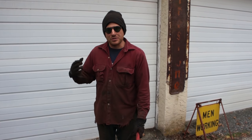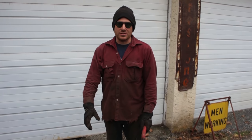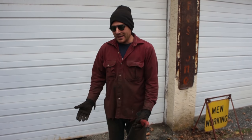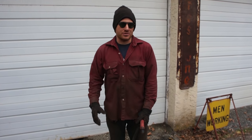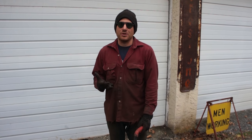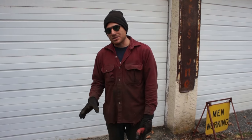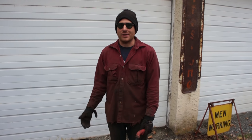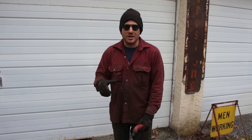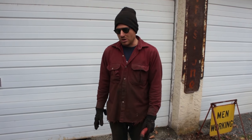One thing to mention when you're using a plasma cutter, the air pressure is what actually forces the molten metal or slag out of the way, and you need that air pressure to punch through. So you do need a decent compressor to keep up with it. Traditionally, Eastwood VersaCuts, I think they say to max it out at like 50 or 60. I'm actually running it a little over that, at 70 or 80, so that when I'm making these long cuts, the compressor is leveling out at around the 60 or 70 mark.